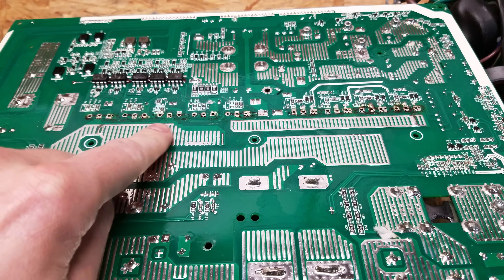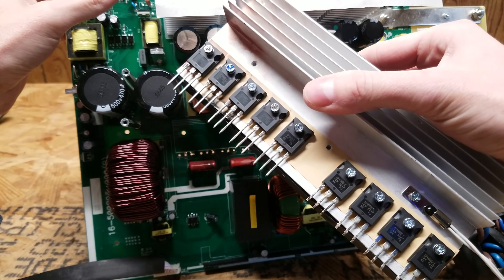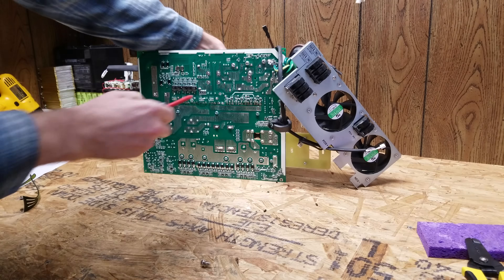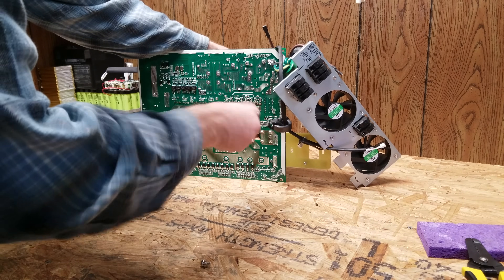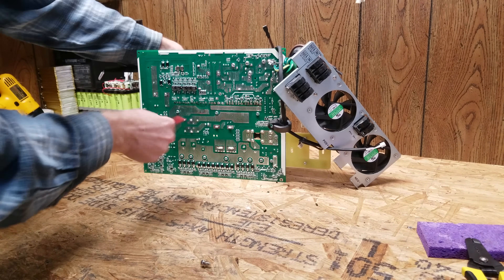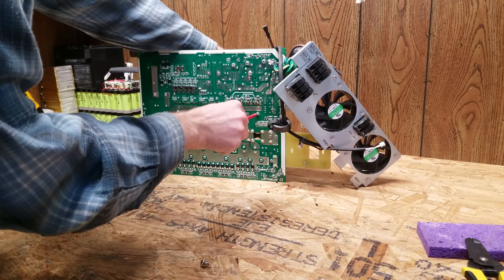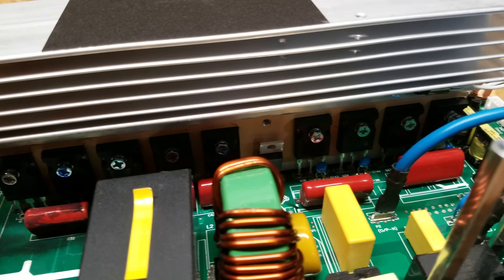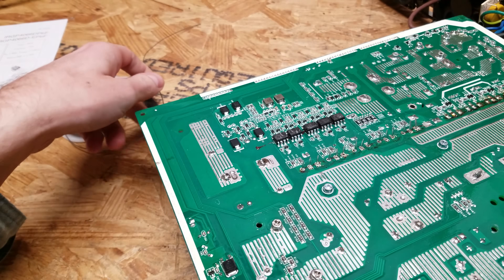You could use a toothbrush carefully on there and that would probably help. The next step is taking this block of transistors, lining up the pins, and just sticking it straight through. I managed to get all the pins back through, and now I'm tightening down the three screws that hold the heat sink into place — I don't want to over-tighten it, but making sure it's tightened down well enough to hold. I just need to tighten down those individual screws on the MOSFETs, and now we're ready to solder these transistors to the board.